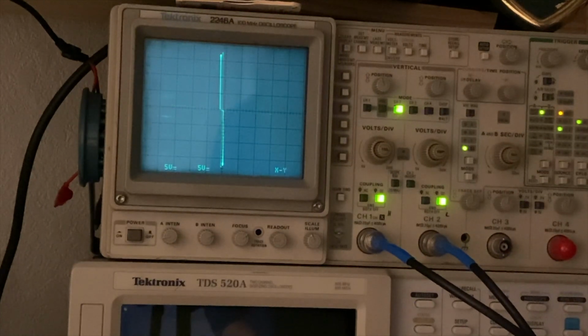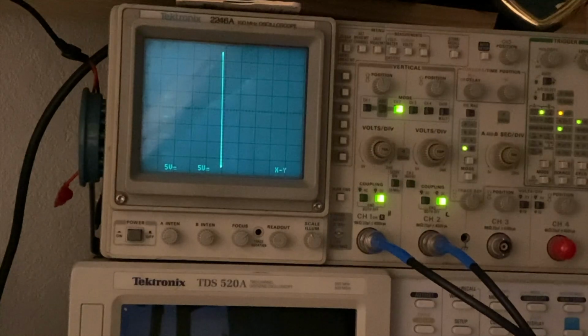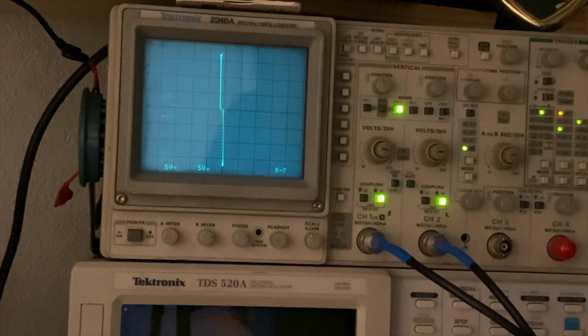Pin 10, one side shorted, so left side, right side, left, right. Pin 11, identical. Pin 12, well, we can't say reference, we can say left side, right side, because they're both bad chips. Pin 13, both shorted. Pin 14, both shorted. Pin 15, both shorted. Well, maybe not, just a little bit of difference on 15 there.